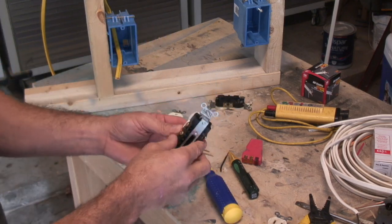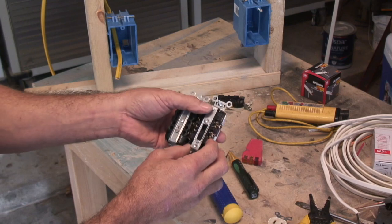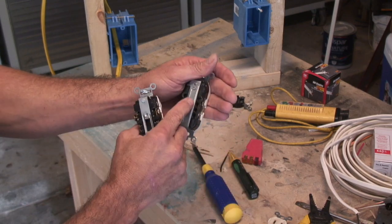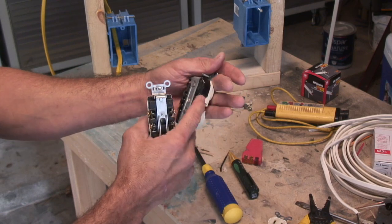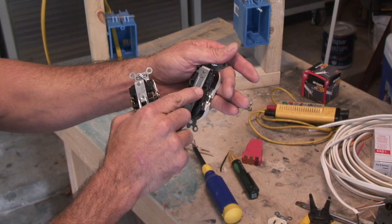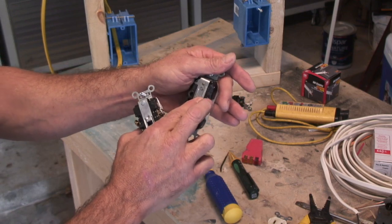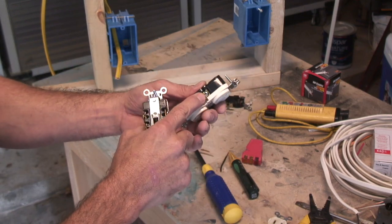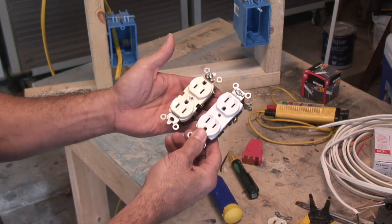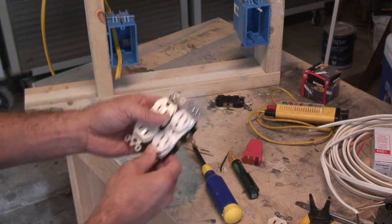This is the kind I would highly recommend — they work basically the same way. You have holes here but there's a little clamp inside, like a vise. When you screw the screw on the side tight, it pulls and clamps it in there really well. You can snug it down real tight and you don't have to worry about it loosening up. That's why these are definitely better than the other type.